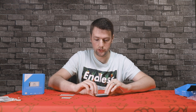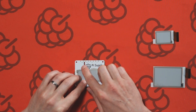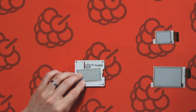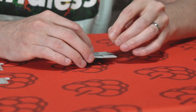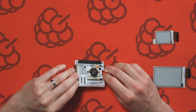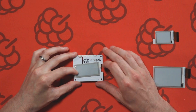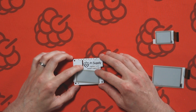You may have noticed there are some solder pads at the top labeled SW4, SW3, SW2 and SW1 — this is where the switches go. You'll need to place the switches in and then solder them on the reverse side. Once soldered, you'll be able to use them to change the display on the ePaper hat. You can also see there's a little cutout made for the Raspberry Pi camera as well.